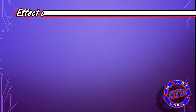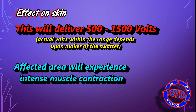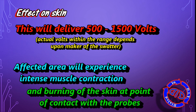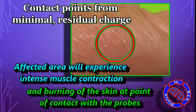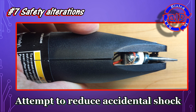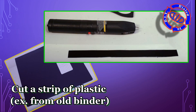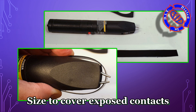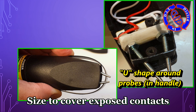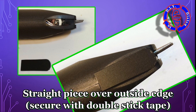This can have a residual charge that is held, and when it has this many volts to start with, that's not surprising — so make sure it's discharged. If this hits your skin, it's going to cause some serious muscle contraction and it will burn the skin. I got a shock from hitting a residual charge to a finger, and that caused burns as you saw in that picture. So I got some recycled plastic material that I cut to the perfect size to cover any exposed wire or space where you might accidentally come into contact with one of the probes or connections without intending to.